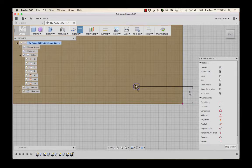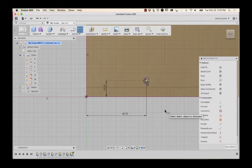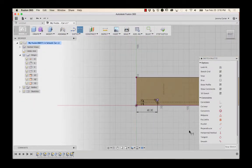Note, on this design, the bottom of this car body will be the actual block bottom face, and these dimensions we created will ensure you comply with the regulations related to track clearance and distance of CO2 canister hole from the track surface. Using the Dimension tool again, select the center of the circle nearest the CO2 chamber and the left back edge of the block. Click to edit this dimension and change it to 40 millimeters. Change the distance of the other circle to 60 millimeters from the front of the block.